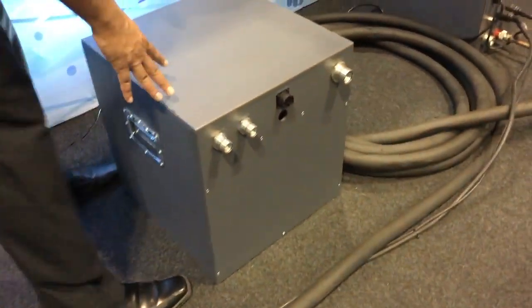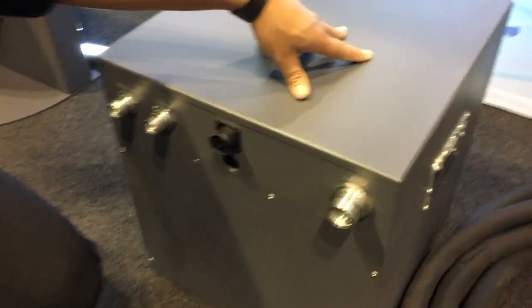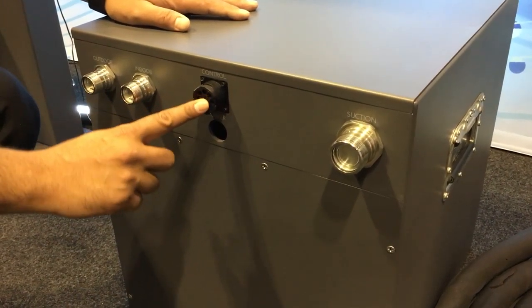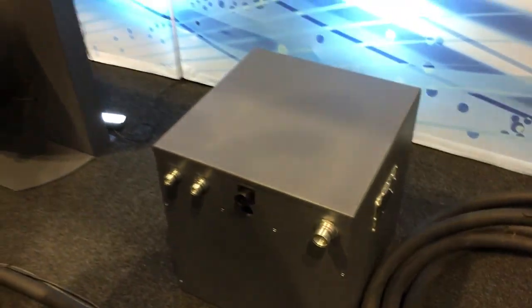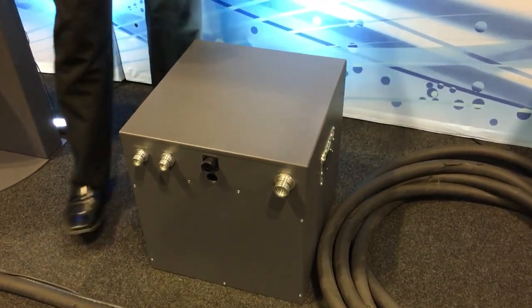We have the option for remote compressors as well. This is our compressor box — it slides into the bottom part of our air handlers, but we have it on display here. Your compressor sits in it, it's sound deadened, and everything uses aluminum frames. You connect the lines the same way as the condenser using turn-and-lock for electrical, sensors, thermostats, and indoor/outdoor suction, liquid, and discharge lines. The compressor box is 135 pounds, and with the two handles you can take it out, put it on your workbench, and easily do whatever compressor swaps are needed.